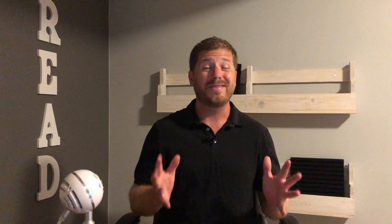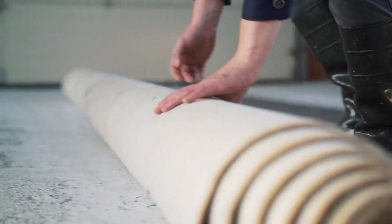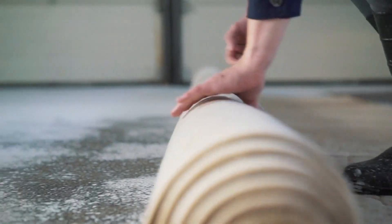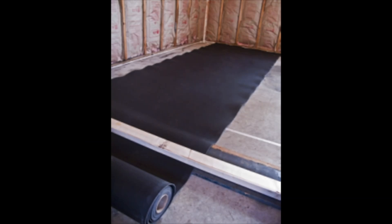For those serious about soundproofing, carpeting and rugs are quite essential. Once flooring is installed, there's an underlayment for the carpet and then the carpet itself. It might seem excessive to have so much soundproofing material, but it's something many people have relied on. Even mass-loaded vinyl placed underneath the carpet — if you didn't put it in the subfloor — is another effective and easy option.